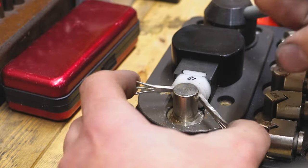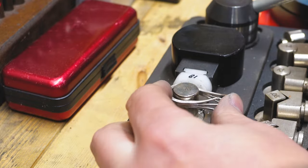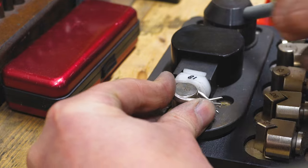Once I've got my three claws per side, I anneal the ring, put it into the ring bender, and I'll sit with a shape which is U-shaped. But if I just keep it like that and bring it together, I'm going to have the claws touching — and this design is not one where the claws touch in a triangle. So I'm bending it like that, then like this, and then bringing it down — that's the idea.